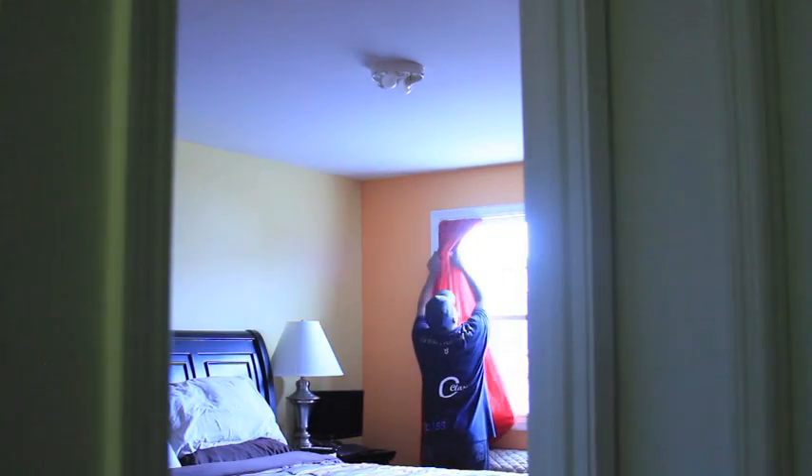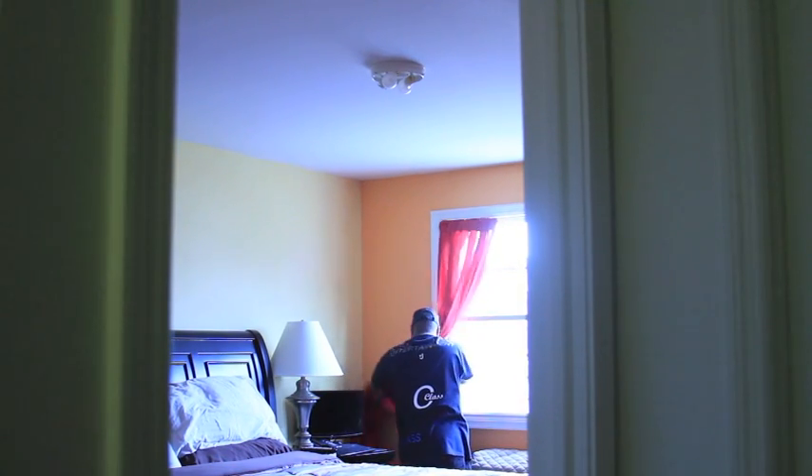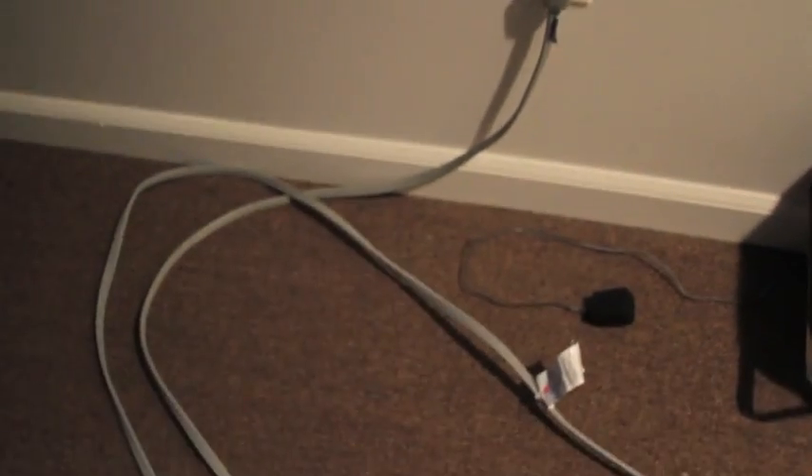In my case, I am able to observe the power being removed as I'm flipping the switch at the circuit breaker box. In a larger home where this is not possible, a helping hand goes a long way. But even then, repeat this step several times to ensure that you have the proper circuit. Here's the reason for doing this during the day: you'll need all the light you can get. Here's a tip from videography and photography — always have your own light, meaning use an adjacent room or circuit that's not turned off to plug a light and extension cord in to light your work area.